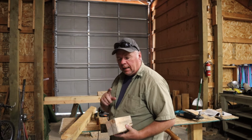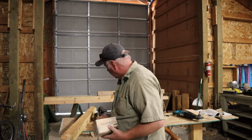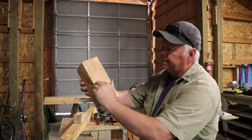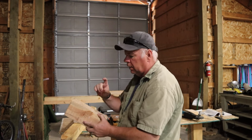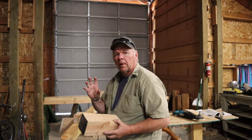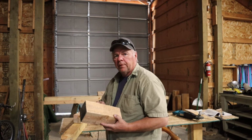So the second blade I put on it was a 3/4. I think they call it a kerf. A 3/4, the gap between the two teeth. And I got this finish. That's the second blade I put on it. I got this finish. Now I don't know if you can see it, but it was really abrupt, and I just thought that I purchased the wrong kerf or gap in the blade, because the blades I purchased for the replacement were all-purpose. The first blade that came from the factory was for hardwoods, and I just wanted an all-purpose one and put the second blade on.